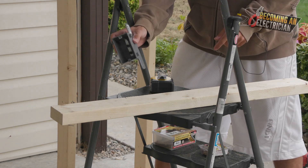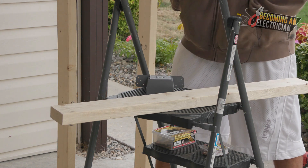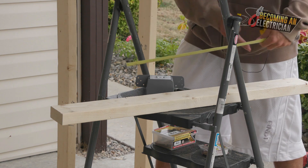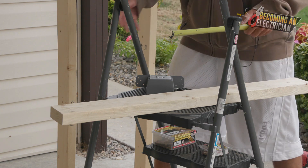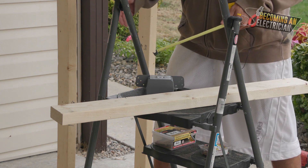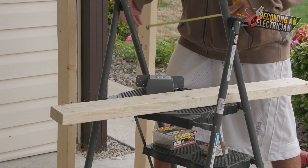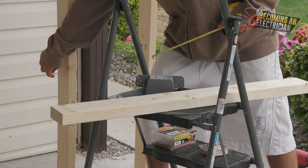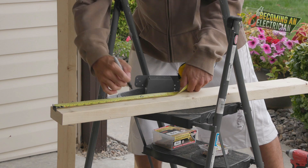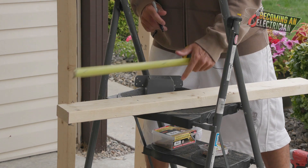If you are doing a lot of single-gang switches, I would just recommend cutting a whole bunch at 10 inches. You take your tape measure and mark 10, 20, 30, 40, and then just cut a whole bunch. But if you are installing a light and need to put a scab across to center it, you'll have to custom cut those every time. For something general like a scab where they just have an X and you need to block it out, it's going to be 10 inches, or 20 inches for a double.